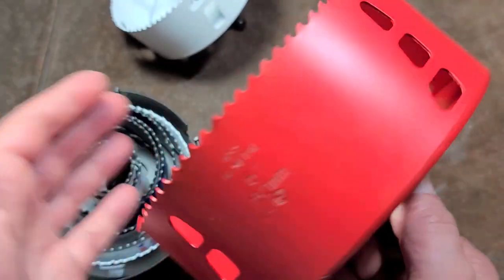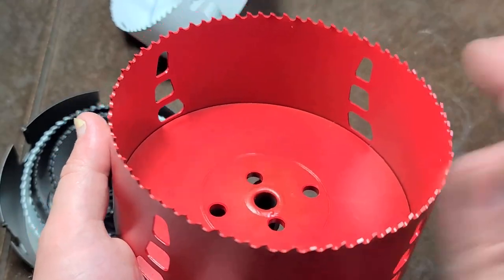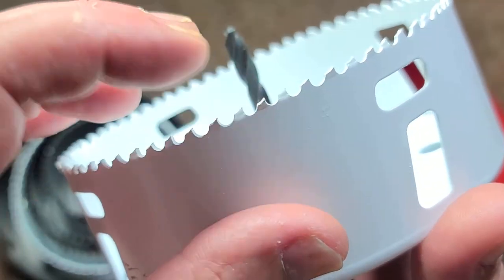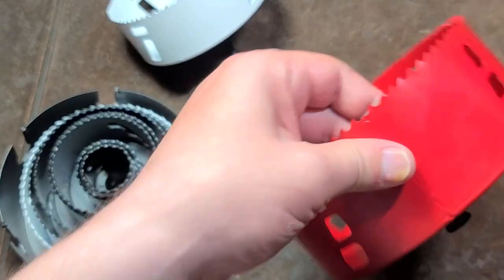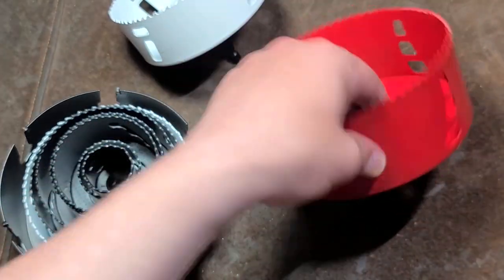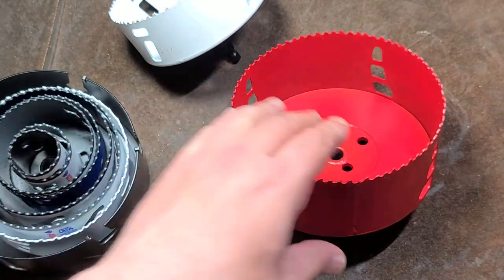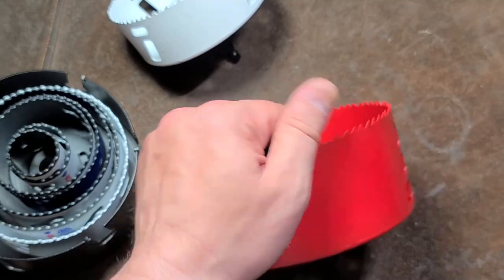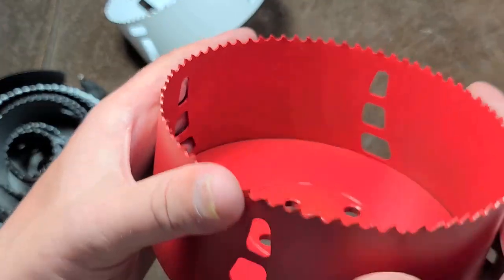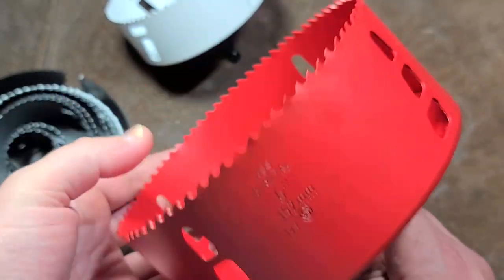It's no different than a reciprocating saw blade — if you run into nails or anything else, you can instantly destroy a hole saw on just one shot. Hit a deck screw and it's instantly ruined. I think that's kind of the idea with the Milwaukee hole dozers: they use more reinforced teeth. Anyway, besides that, it seems like an okay hole saw, but it's annoying that they include the arbor because now it won't sit flat. If you have multiple ones with the arbors, you're not going to be nesting them together, and they're going to take up a lot of space. Big ones like this, if they're kicking around a truck or a toolbox, it's really easy to get them dented or warped. If other tools or hammers land on them, they get beat up, and then a hole saw that's dented or slightly oval is really tough to use.